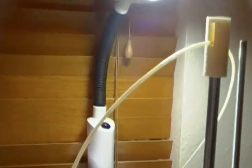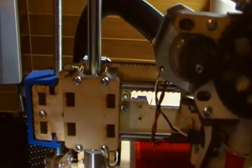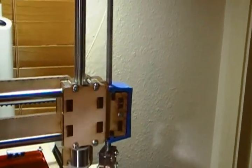You can see my filament guides sitting on top of the smooth rods — those are nice and printed. I've also got the z-axis nut traps blocked off, so that if you accidentally bottom the carriage you don't have to manually move the nuts. It keeps the nuts trapped.